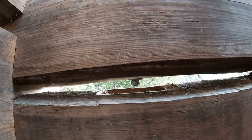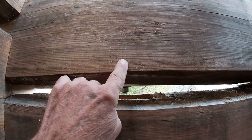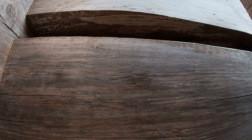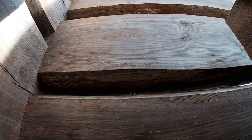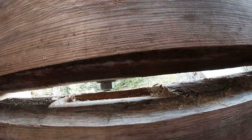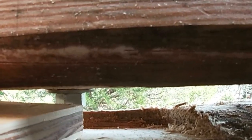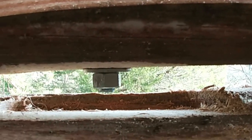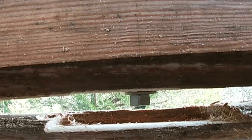I have my nut and my washer on there. When you're putting something in like this, if you're precise with your layout — coming from the shoulder, this is 10 inches back — and they were all the same, I drilled them all 10 inches back all the way up, so when I put that rod in it just slid right straight in. I put a block right here to catch it so I could push it back up a little bit and get my washer and nut on there. Being precise with your layouts and drilling holes just pays off when you go to finish out what you're doing.